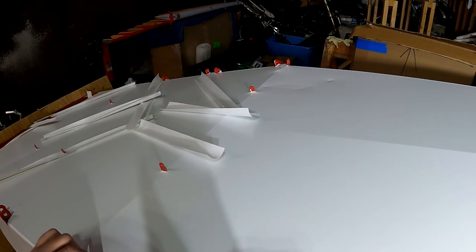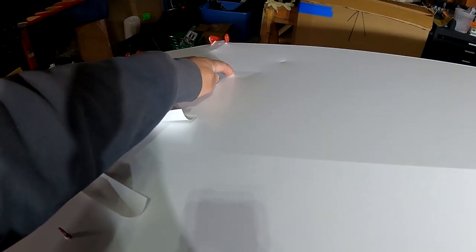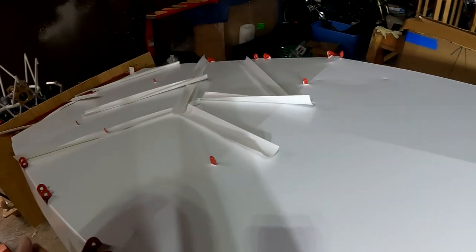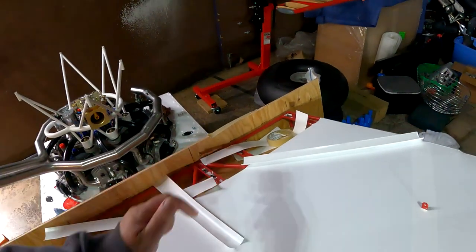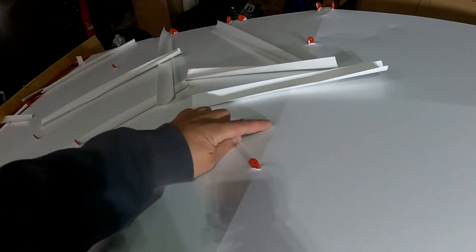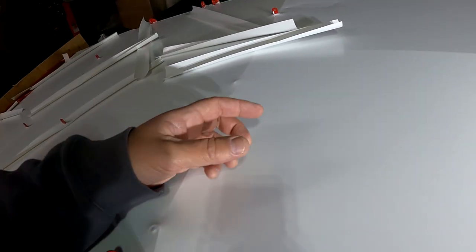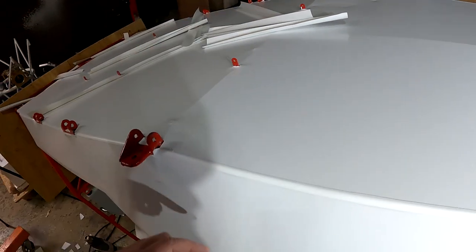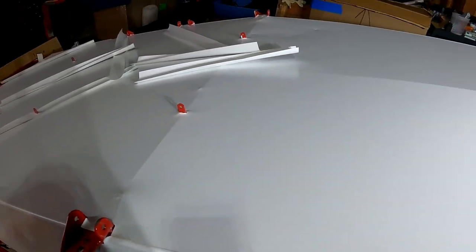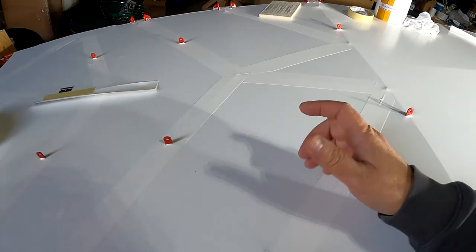This right here is where one of my ELT antennas is going to come through. I'm still grouchy that I have to have two antennas — my Stratus ESGI transponder used just the one antenna, but this one has to have two: one for the echo UAT and one for the Sandia STX 165. One will be here and the other has to be at least three feet away, so I'm going to have it poke through the stainless part of the firewall. I just remembered a hole that needs to be cut for the header tank sump drain underneath here. If I had any firing neurons left I would have done that hole before I covered this side of the fuselage — but that ship sailed, so I'll do it the hard way.